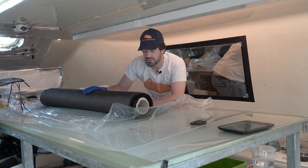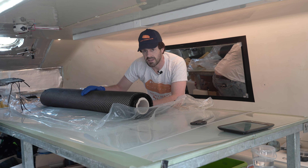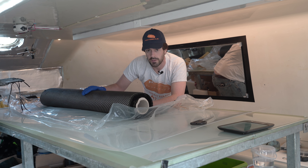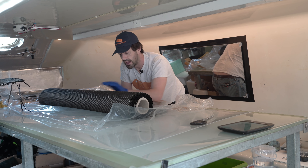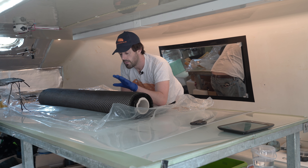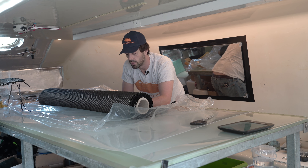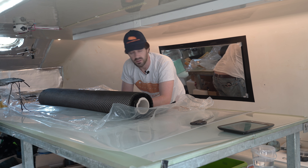Normally with boats you go for glass fibre because glass fibre is strong but it's very dense, so weight is not an issue, and you just go for glass fibre because it's cheaper. I'm going to be laying it up using polyester resin, and that may surprise a few of you because normally you associate using carbon fibre with epoxy resin, which is the highest performance resin, but again it's just a budgeting issue. It would cost many times the amount of money to set this up with epoxy resin, and I don't need that final extra percentage points in performance out of this lid for the cowling. Anyway, let's get on with it.